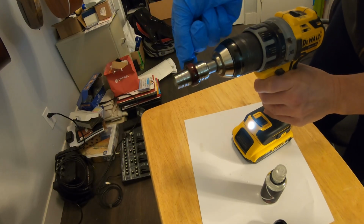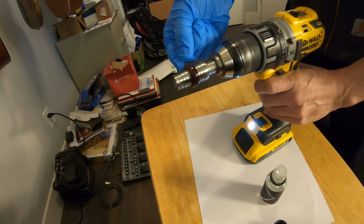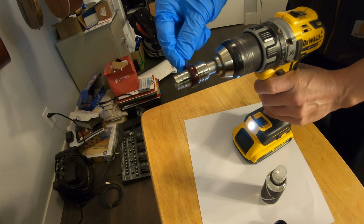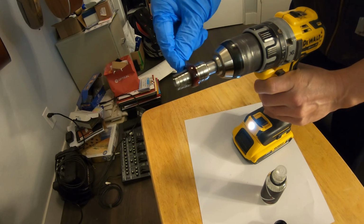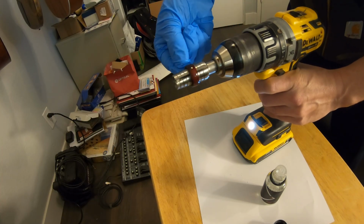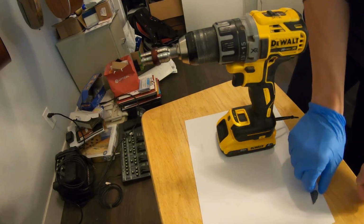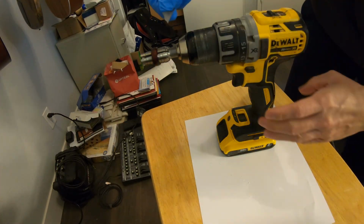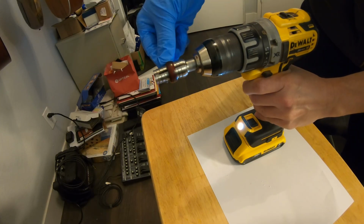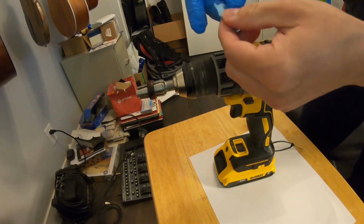On a gigantic table, it might be a rush to get the finish applied everywhere before it starts to cure, but on something tiny like this, it just takes a few seconds, so I simply continue to apply it for 30 seconds or so. After applying it for 30 seconds, you let it sit for about a minute and a half, then very lightly use a clean piece of the applicator cloth to absorb any excess. After absorbing the excess, you just gently buff it with a clean microfiber cloth.